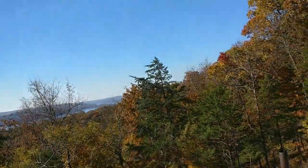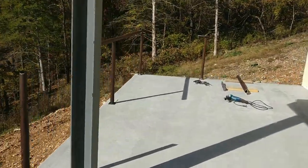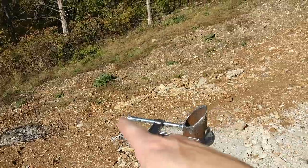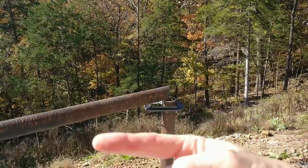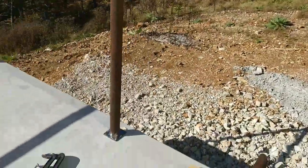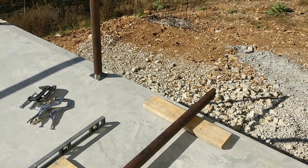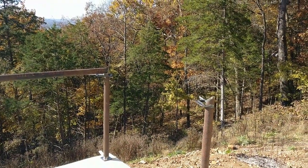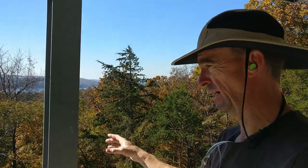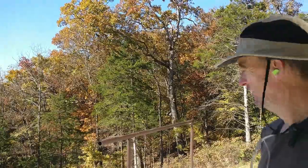Now down here I'm working the two corners first. This was a really hard cut to make but I got it dialed in. I have a 45 coming up and over, and my next 45 is from that angle to that angle - perpendicular in a different axis. I have it cut and it fits perfect. Now I'll do all my grinding and start welding this corner, then go to that corner. The pieces in between are just square cuts, and I'll figure out my third piece of pipe here, clamp them, and hopefully everything runs true and straight.